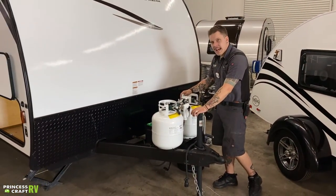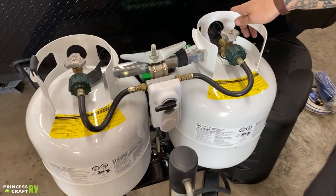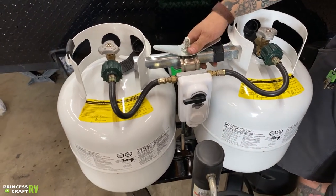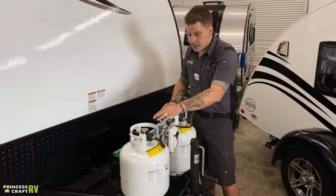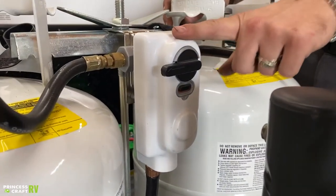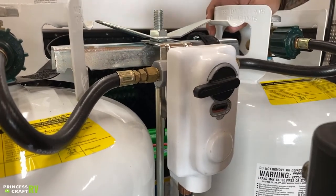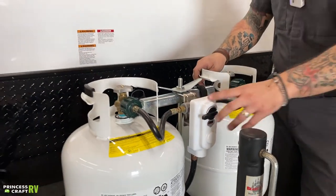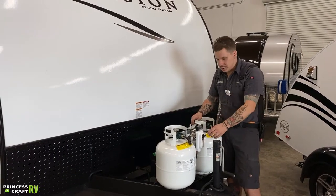Up front we have two 20-pound propane tanks, which are full today. You have an open and closed valve on the top, separated by a T-bar and a regulator. To remove these tanks for filling, unscrew the oversized wing nut, rotate the T-bar out of the way, and disconnect the pigtails. Whichever tank you have open and wish to draw from, make sure you're directionalized to that tank. If you have both tanks in the open position, once one is used entirely it will automatically switch to the secondary tank. To avoid that, keep the secondary tank in the closed position and open it when you wish to use it.